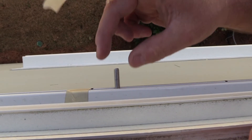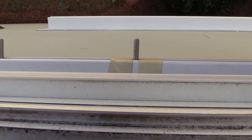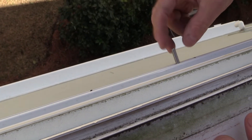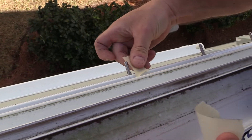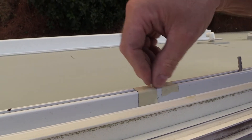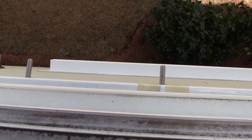If you see the black mark there, that's the center bolt. We place one piece of tape and then a second piece of tape — that keeps the bolt in the exact position. Over here we tape this one on that black mark. That gives us exactly 12 inches between those two studs, center to center.